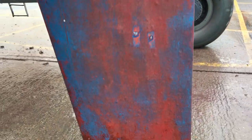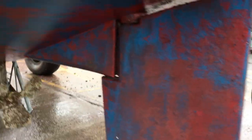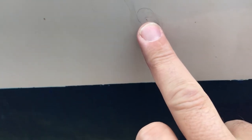The other thing here is we've got a bit of osmosis on this rudder too, which means that saltwater has penetrated the outer layer, got into the construction of the rudder, and is pushing the top layer towards us through osmosis. You can tell if a rudder's got osmosis by these kinds of bumps — if you can see them. Using the ship's hull to help explain: underneath the gel coat of the rudder we've got the actual construction. The top layer will look like a nice white shiny coat, and then on top of that will be layers of antifoul, similar to the rest of the boat here — and the antifoul is what we can see here.